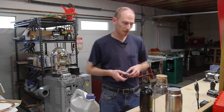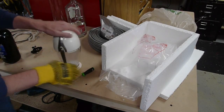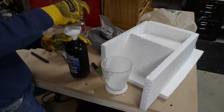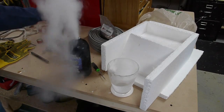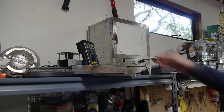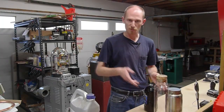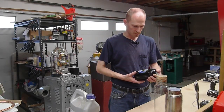Next I wanted to do a dry run. I packed the chamber with some dry ice — didn't really measure too much — just wanted to make sure there was enough dry ice to make a supercritical fluid, swish it around, then release the pressure slowly and pour out the solvent to clean the chamber. I put it in the oven, raised the temperature, made sure it went supercritical, took it out, brought it back down, and poured out the solvent. I had some water and ethanol in there as a basic solvent, and that cleaned out some more gunk.